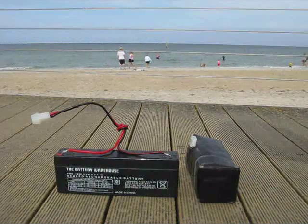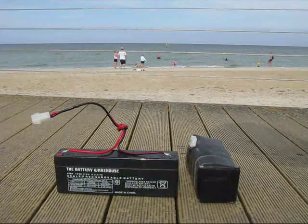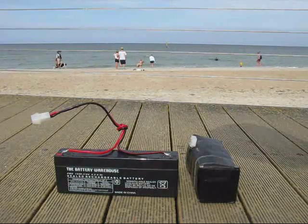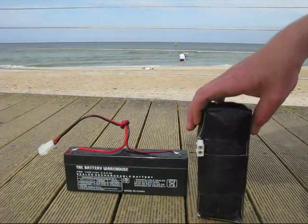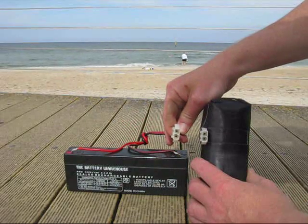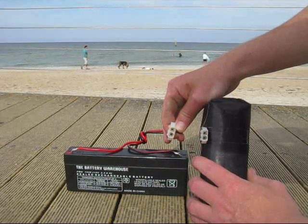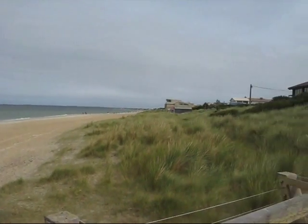There's also lithium batteries, both non-rechargeable and rechargeable, like lithium ion. You get them in mobile phones, etc. They are lightweight but expensive. So if you want something that's the ultimate in capacity and don't care about the cost, then lithium may be the way to go. You'll notice that on all my batteries I use a standard connector. It's just a 2-pin type, quite robust, easy to solder on, and then I've got a separate connecting lead that goes to the transceiver.